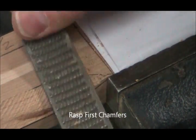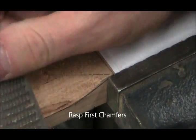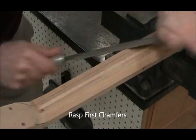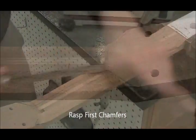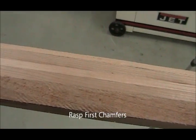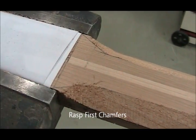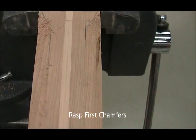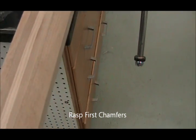Here we're cutting again. Don't get too close to that three and three-eighths line. Now doing the other side at twice speed. When you're done with the rasping, you'll have two roughly 45-degree chamfers. If you've done those right, this will establish a good geometry so your neck is symmetric on the left and right sides.